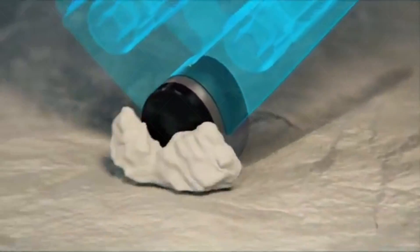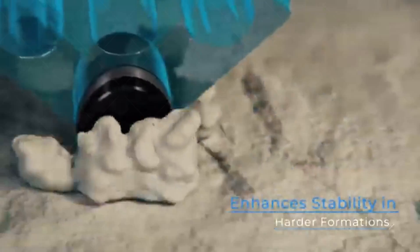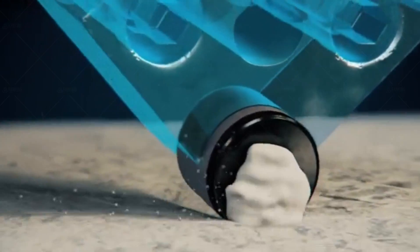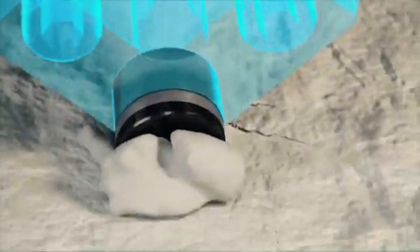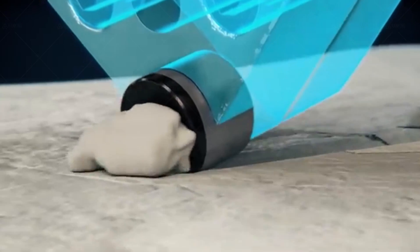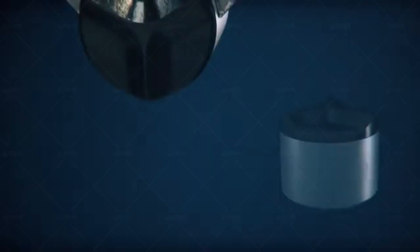One part of the learning curve is how to drill balling clay with a PDC. Bit RPMs are not such a big deal — operators just need to find the sweet spot that the rig and the hole like and get after it. One thing about soft balling clay is the ability to out-drill the bit. When this happens, it balls up and pretty much quits drilling. Torque goes down and pressure goes up. Most clays have a strong electrical charge on each particle. As that clay gets drilled, those charges push the clay to reassemble itself as soon as it can — that's a bit ball.